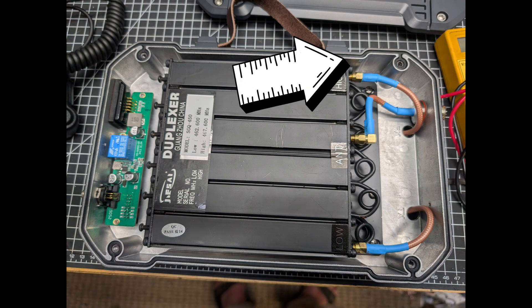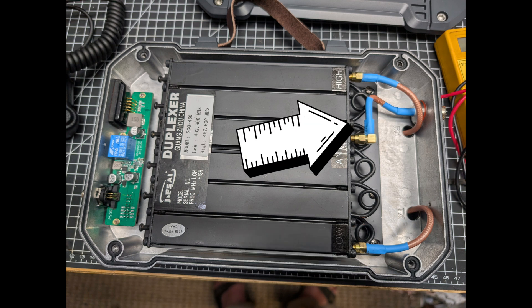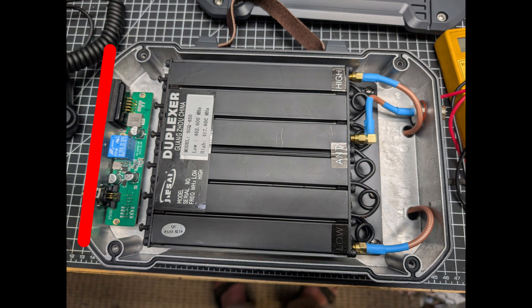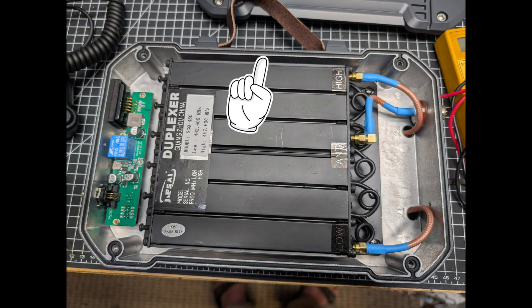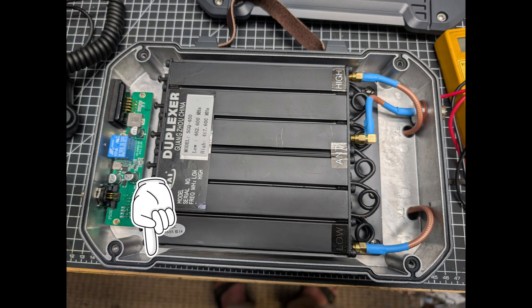Let's take a look at the other side. This is the high-side output off the duplexer, and then we've got the low-side input of the duplexer, and here is the outlet going to the antenna. What's unique here is you could remake this jumper and make it an N-type connector for the output. Here's the duplexer itself — a completely assembled unit. Obviously they buy that and stick it in this hole. And this is the I/O board off to the side where all your input comes in. Again, we've got this lovely gasket all the way around this die-cast aluminum enclosure — it is a really solid way to construct a radio.